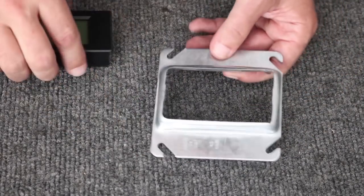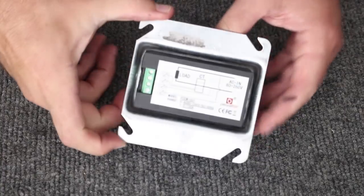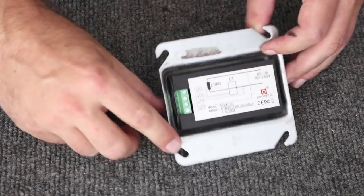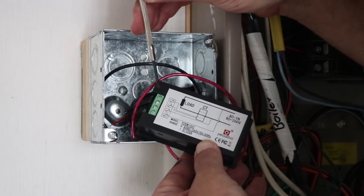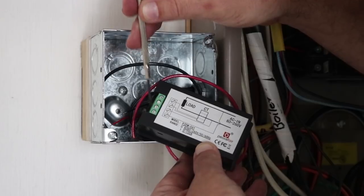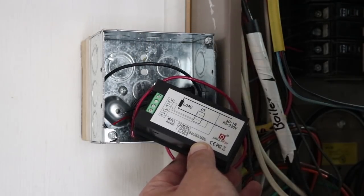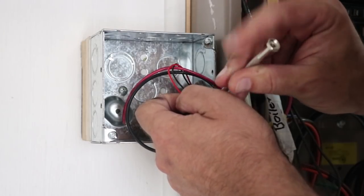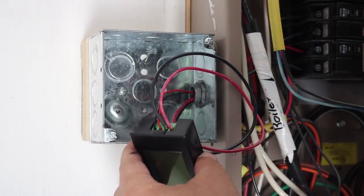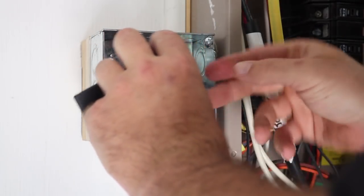Now the panel meter pretty much pops right in — we've got a nice little panel. It's going to be a little tight for the wires, so I'll want to pull the wires through, wire it up, and then snap it together. Looking at the schematic, the top two screws are for the small current sensor wires, and the bottom two are for the power wires — in this case the 14-gauge wire going to our 15-amp circuit breaker. I got all four wires in there; it's a bit goofy because the wires are short, but they all fit inside.